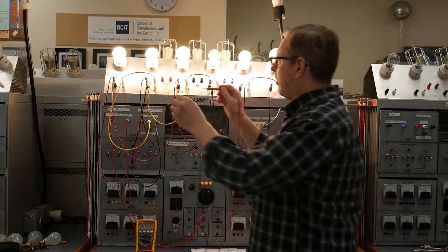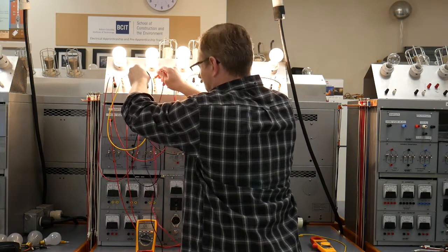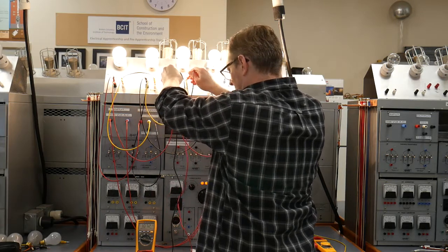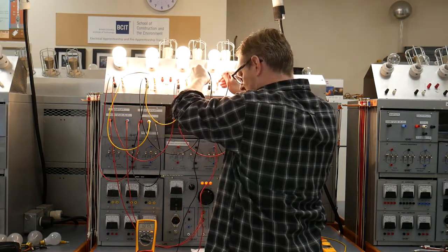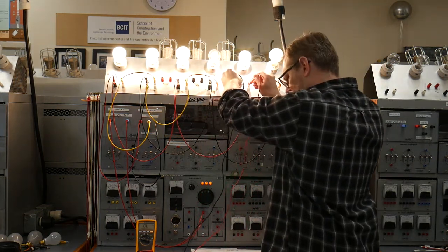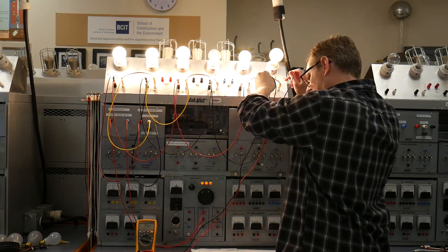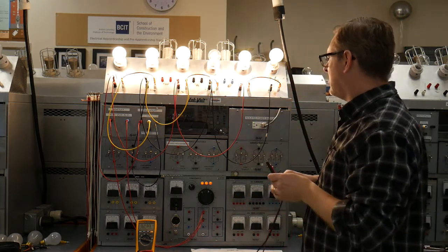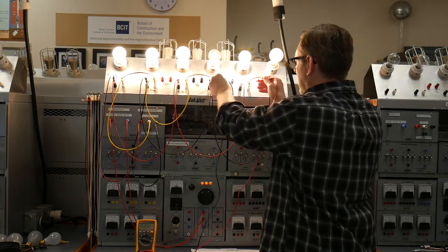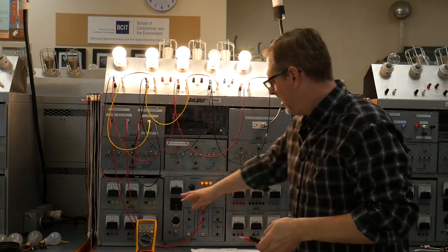Okay, my voltages. R1, we're going to see the 107, which we have. R2, we've got 107 again. R5, we've got 107. And R3 and R6, now we're going to see a difference. R3, which is bright, is sitting at 135, and R6 is sitting at 79. So 107 to 79, we should see a voltage difference across that open neutral point of about 28 volts, which is what we have, 28.36. Okay, I'm going to power that down.